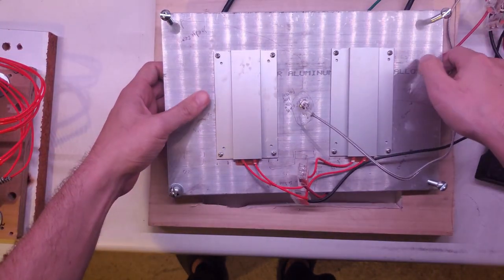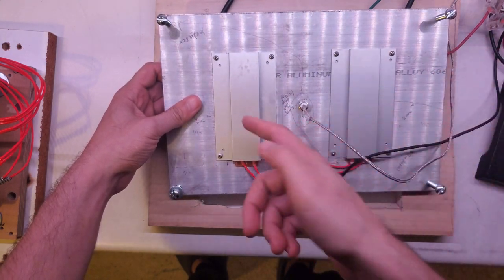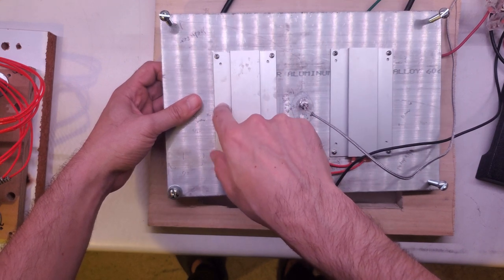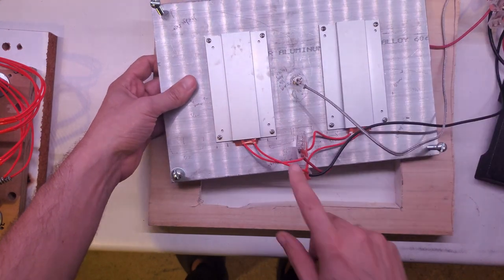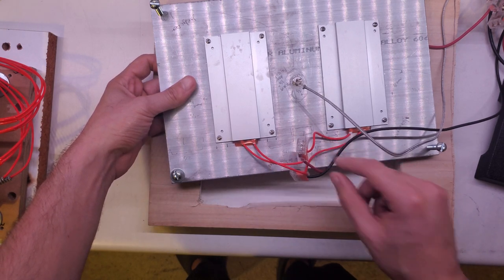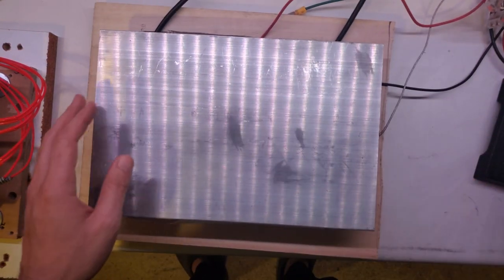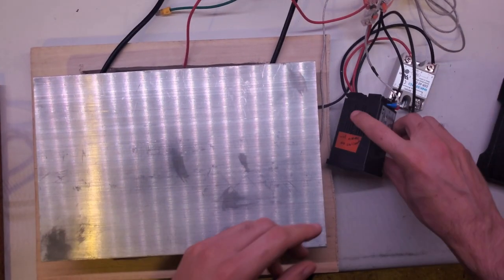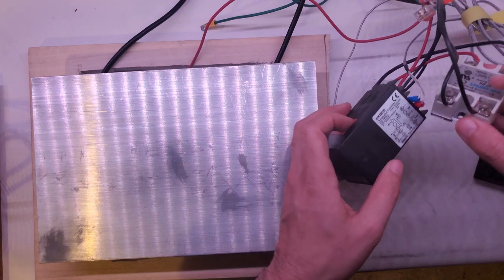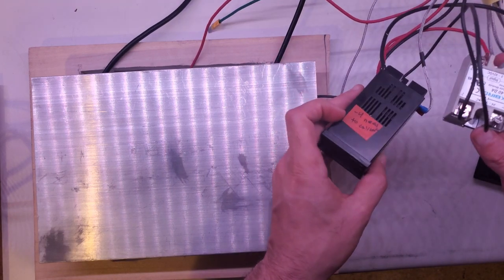The second design uses PTC heaters — these particular ones heat to a constant 500°F, though different temperatures are available. You drill and tap holes and screw them down, applying thermal paste underneath for good heat transfer. Make sure wires don't touch the hot plate — WAGO connectors can't withstand high heat, though heater element and thermocouple wires usually have fiberglass coating. Everything connects to a PID controller; I use the Inkbird ITC-100VH with a relay that constantly switches to control temperature and prevent overshoot or undershoot.